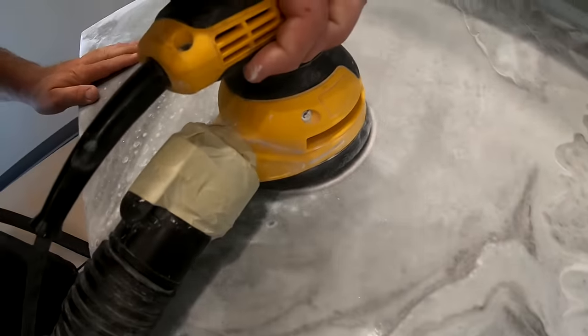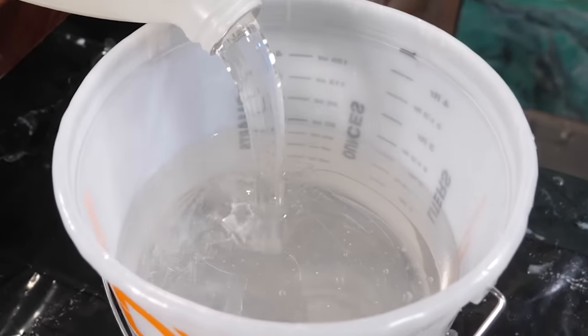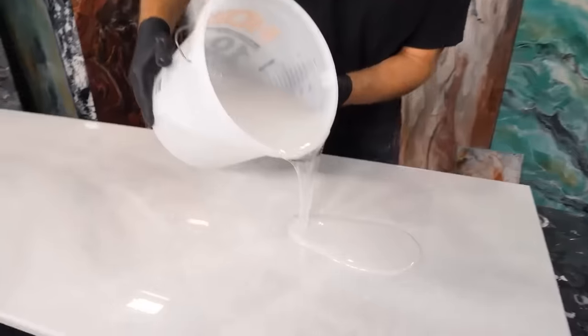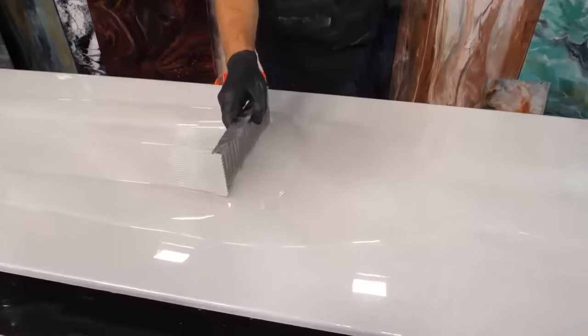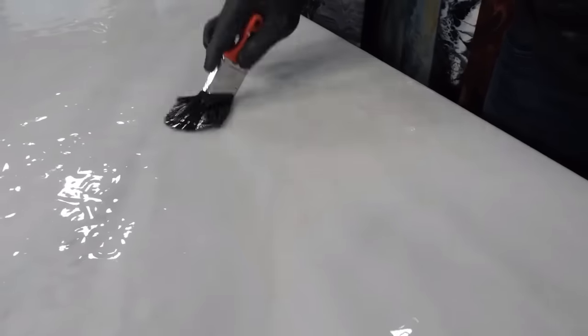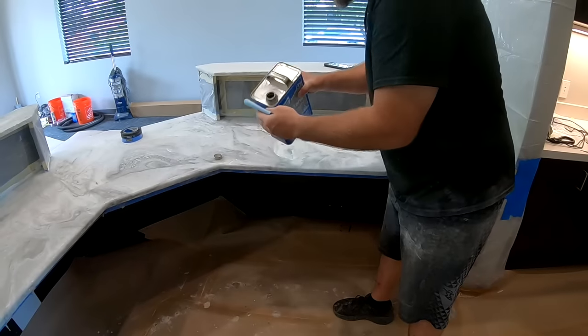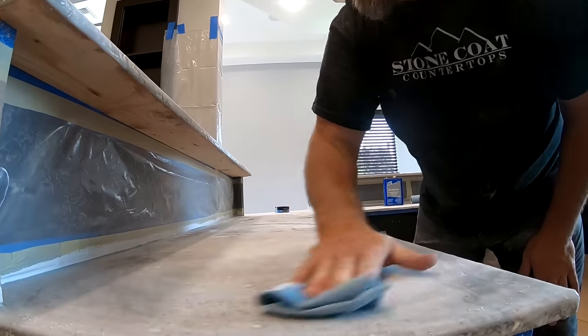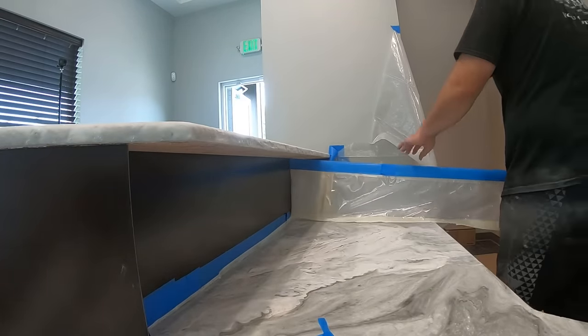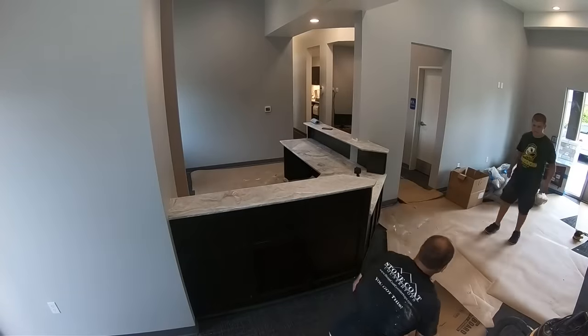You can do a clear coat easily using the same material at a two-to-one ratio, mixed for two minutes with a drill. The color combinations are unlimited. Here's another process I did that mimics Carrera marble very subtly. Whether you use our art coat, countertop coat, or platinum coat, the application process is the same: use our one-eighth by one-eighth square notch trowel to trowel the surface, then chop it with our two-inch chop brush to break surface tension, and finally torch the bubbles out. After the clear coat is done, I'll sand it and wipe with acetone to remove dust, preparing for the ultimate top coat. I'll also remove all masking material so I'm ready to walk away after the top coat.